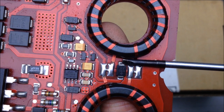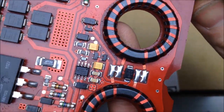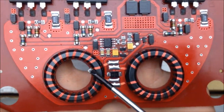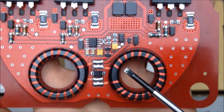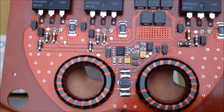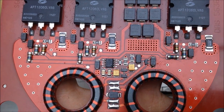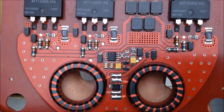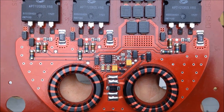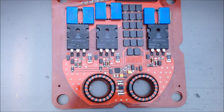Between those two coils there is a zener diode which clamps the current and voltage to a certain point. So here we have basically our power and signal input, and they pretty much fire at the same time due to the fact that these are in parallel configuration. The majority of components on the rest of the board are actually for protection. I'm going to bring a board that's been broken down so we can take a look at the simple circuit side of things, before every vital protection component is stripped off.